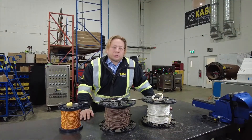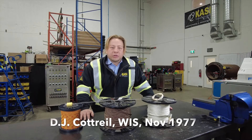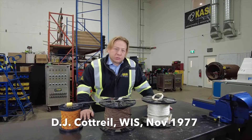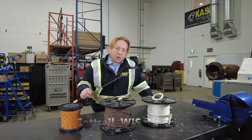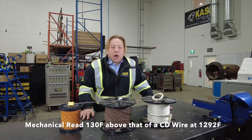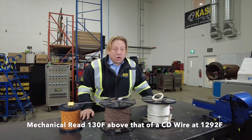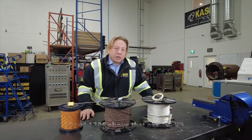DJ Cottrell presented at the Welding Institute symposium in November of 1977. He documented in his research that a mechanically attached thermocouple read 130 degrees Fahrenheit higher than that of a thermocouple attached by capacitor discharge methods at 1292 degrees Fahrenheit.